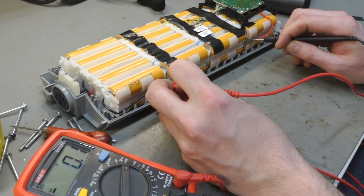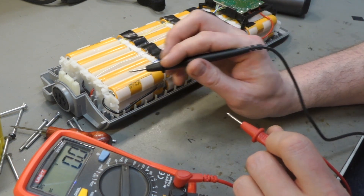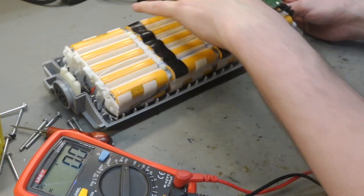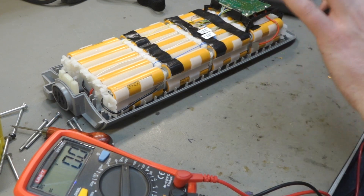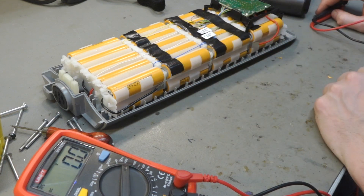It has really old LG cells — it smells bad, I think there's electrolyte in here. You can probably not charge it when it's at 0.1 volt, and here you can see cracks. This has not been used in several years. We will not offer her a repair because we cannot verify that the electronics are working, but we can buy it from her. We have another Bosch BMS that we can try and test later on.